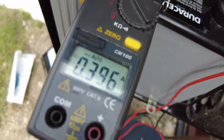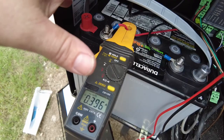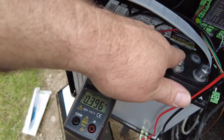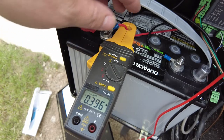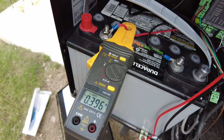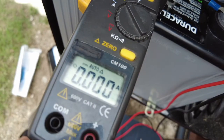I'm going to watch this meter while I try various things and I'll verbally walk you through it. Clamp onto one battery lead — it really doesn't matter which lead. I like to use the positive lead because I don't like to get a negative amperage reading, but technically it doesn't matter a whole lot. You've got to zero it out. Now everything's powered down.